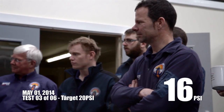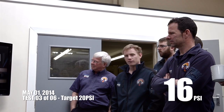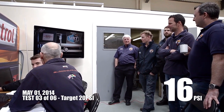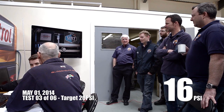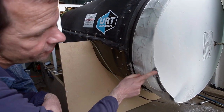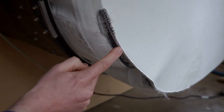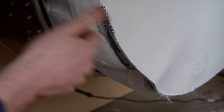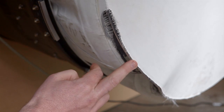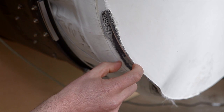The bag is going in there. What's happened is it's obviously had a lot of tension on this edge, and because it's got a sharp edge it's created a huge stress raiser on the corner that's ripped it. Then the moment it let go, you've suddenly lost that load link, and that's why it's kinked.